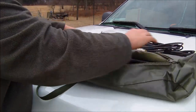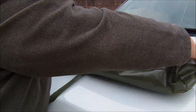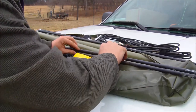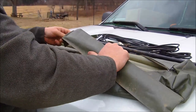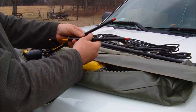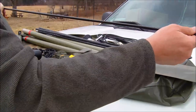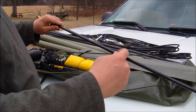It has the mast, which we'll be setting up. It also has four different antenna elements — two go together, one for 80 meter and one for 40 meter. There are also additional telescopic pieces. The idea behind this antenna is you put up the 40 meter or the 75 meter element, whichever is nearest where you're going to be talking, and then you telescope these out to tune your antenna once you find the frequency you'll be operating on.